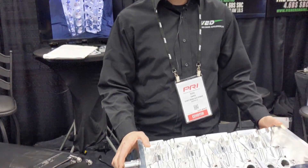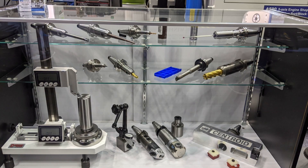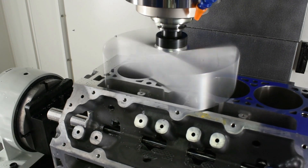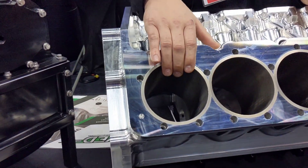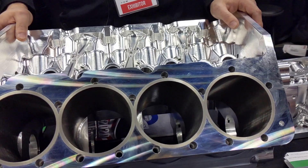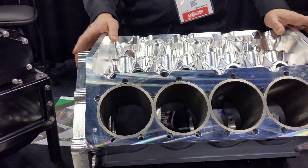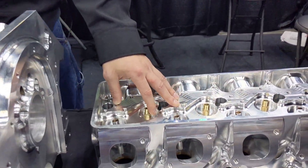We have an A560. We specifically use the crank bar system that they developed with all of the tooling. The best part about the Centroid is the tooling that comes with it — the face milling, the fly cutters for doing the decks, the Kaiser big boring bars for doing the cylinders. They leave gorgeous finishes on all of our products that we make.